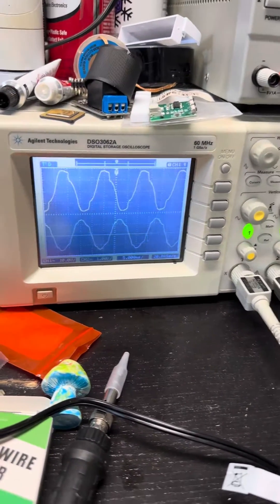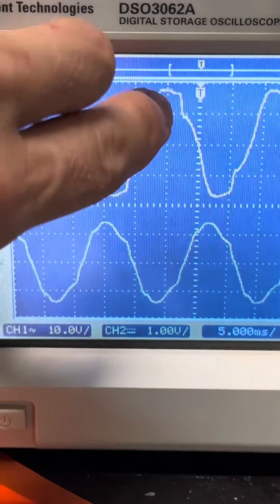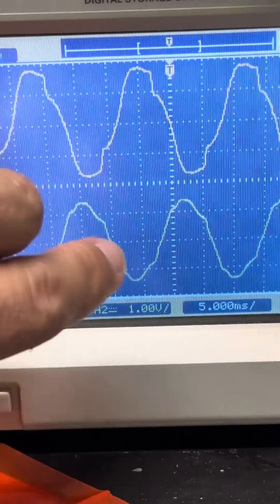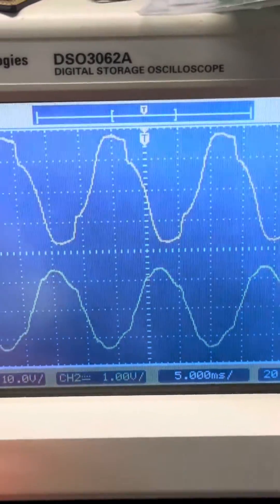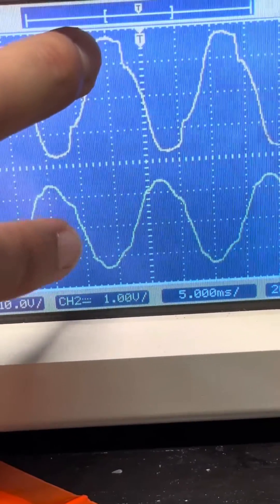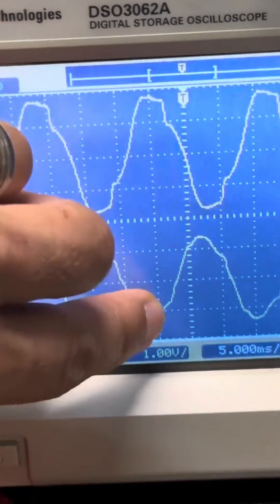I'm going to turn on the soldering iron — you'll see we have a funny-looking wave at first, but it smooths out. I'm going to put the box fan on too. Take a look. You can see this phase is down here — this is a straight line and there's a shift. So on a purely resistive load, we're measuring current. CTs measure current and convert it to a voltage measurable using the oscilloscope. We are seeing a current phase shift, and this is all on one leg. It doesn't even have to be on different legs — this is just a phase shift on a 10-foot extension cord between these two devices. If you were to measure peak to peak, you're no longer truly peak to peak — you're off by maybe five to seven degrees. So with a single CT measuring both, which is what they were doing in the old meter, you'd be undercharging by 10 or 15 percent.